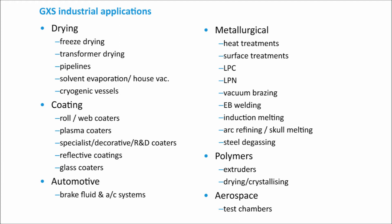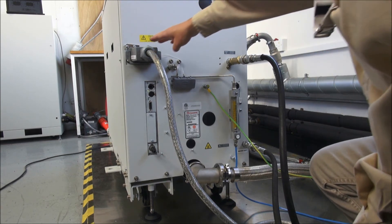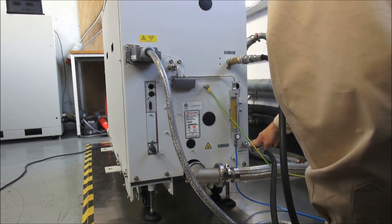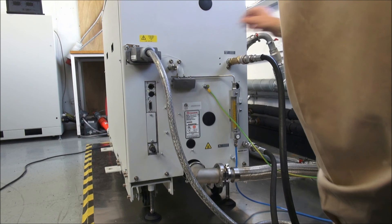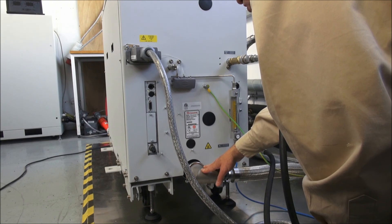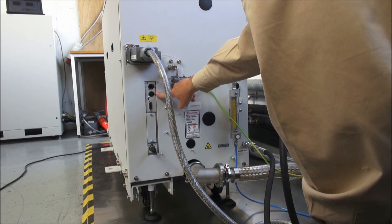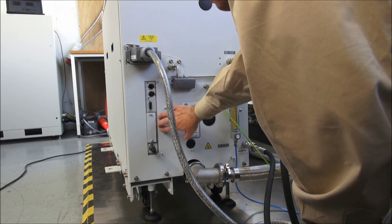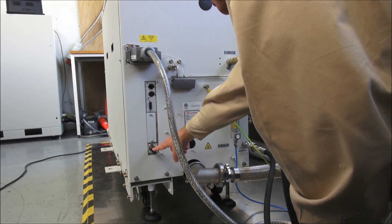All of the utility connections are found on the back of the GXS pump. Power goes in through the Harting connector here. Cooling water goes in here and out of here. The purge gas is connected to the bottom of the flow meter here. There is also an RF safety earth connection and the exhaust to the pump on this version is here — there is also a version where the exhaust can be at the side. Electrical connections are here, including the ethernet port and the serial port. This D-connector is for optional accessories. This socket is for the optional MCM micro terminal for remote hardwired control. And here is the all-important emergency stop system plug.